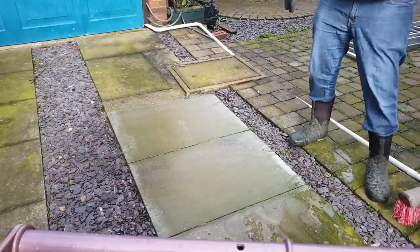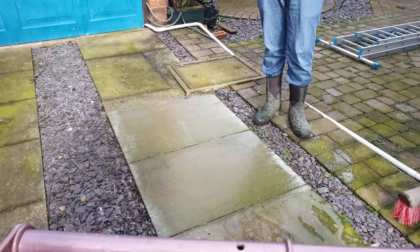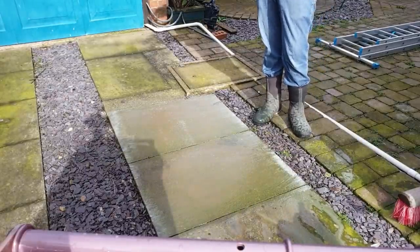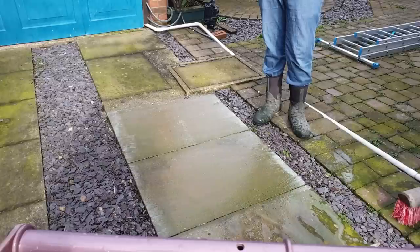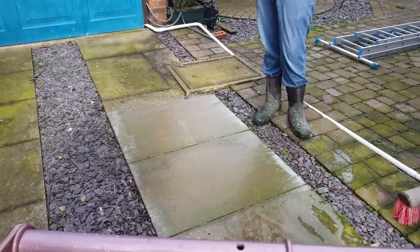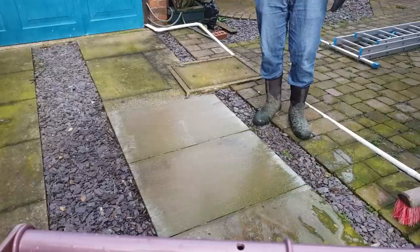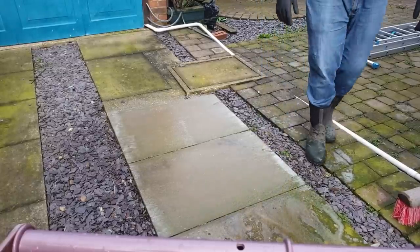So there's round one. Now we haven't used any surfactant here. The term surfactants — used in soft wash — surfactants are for when you're washing a wall and you want your solution to stick to the wall better. You use some kind of soap like a dish soap, like Fairy Liquid or Dawn, just to help your solution cling on and not rinse off so easily. We're working a relatively flat surface here so we don't need to worry about that too much.